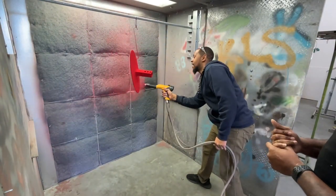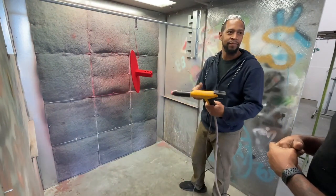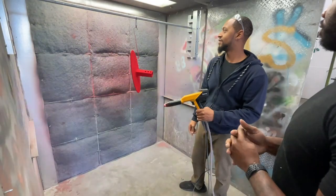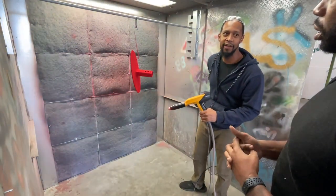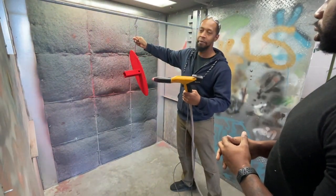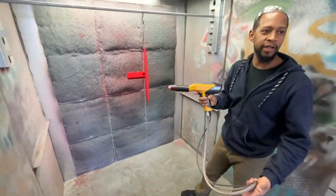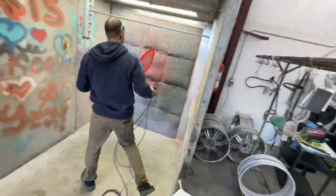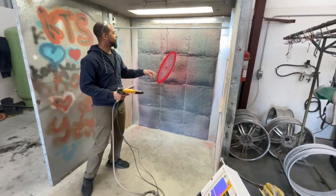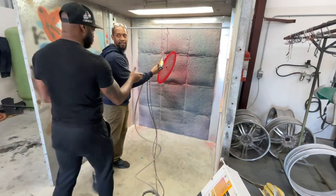It's easier than I thought. You probably use maybe one ounce or so on a piece like this — two pounds can take you a long way if you spray it right. You can waste it if you crank the gun up and start dumping. A good gun setting is around seven pounds of pressure.